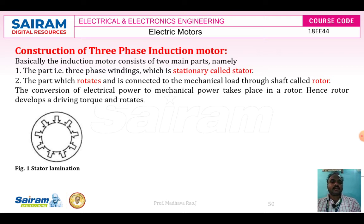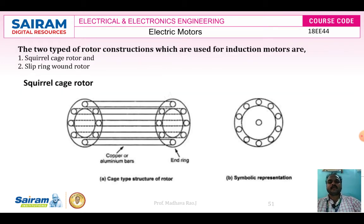According to construction, there are two types of rotors: squirrel cage type rotor and slip ring wound type rotor. Squirrel cage type rotors are smooth cylindrical, and rotor bars are placed slightly skewed — not parallel to each other. At the end of each bar they are shorted using end rings to reduce magnetic locking. Copper or aluminum bars are placed on the rotor surface and shorted at the ends to eliminate magnetic locking inside the motor.